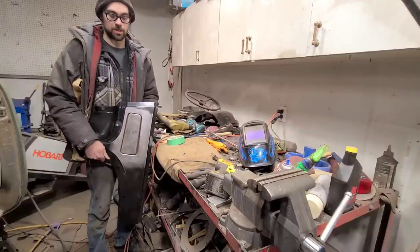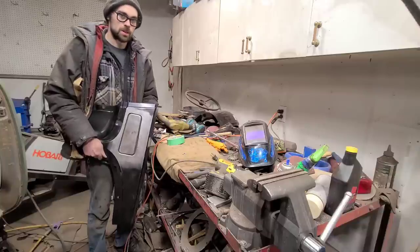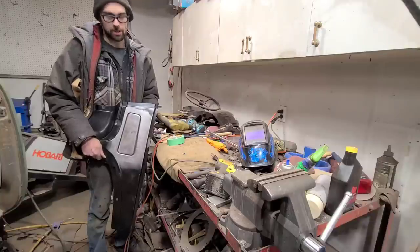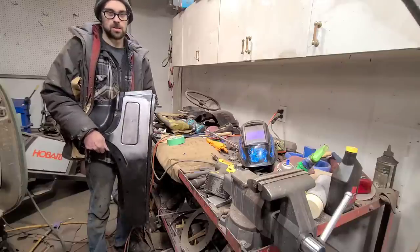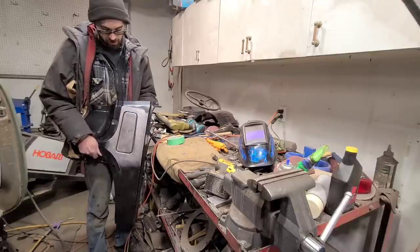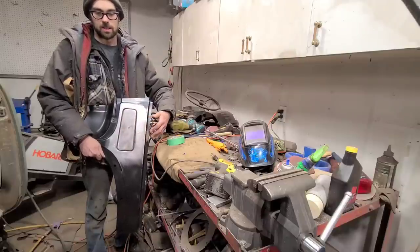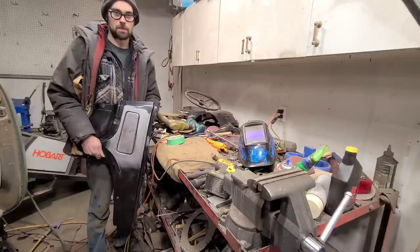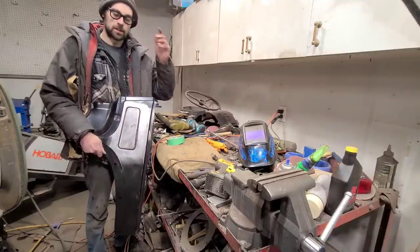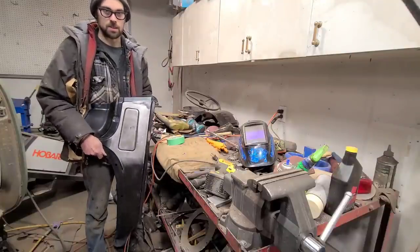And now the truck has the appearance of an earlier truck, which is what we were going for. And for the rest of you, I hope you picked up a few tips on how to deal with MIG weld if it warps on you, and how to correct that easily. As you saw, it didn't take very much to get this back into shape. And it's something you can do with hand tools. And again, if we didn't have this vent in here with this edge and it had warped the way it did, that small amount would have been perfectly acceptable for filler, but because we have this edge here, I didn't want to be trying to fake that out with body filler. So, you know, a couple minutes and we had it back straight again, and it's good for another 70 years.